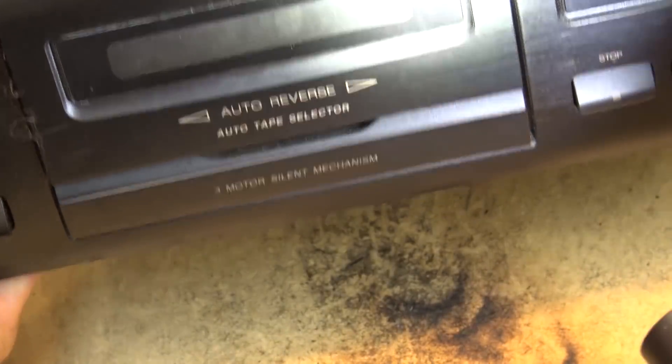Now the reason I'm keeping you guys in suspense — it's a metal tape, but it was the length of tape that was really special, and they were not around for very long. It was made by TDK. Here it is — the Type 4 position MA-110. That's 110 minutes total recording time. The longest metal tape I've ever seen was the MA-110. They made some regular cassettes in the 120 size, but a lot of people frowned on long tapes because they were thinner and had a tendency to stretch or break. These metal tapes actually worked pretty well — I wouldn't use them in a car stereo, but in a good home deck they didn't sound bad. I bought a few of these tapes and have had them for a long time, and they've always worked quite well.